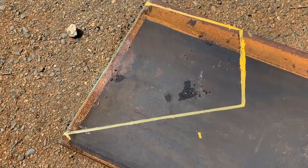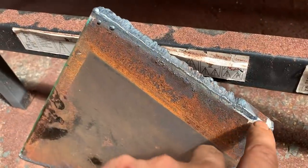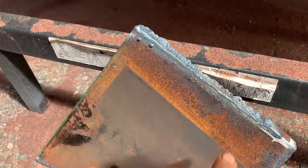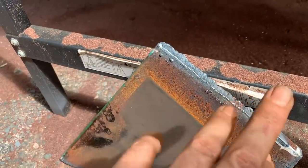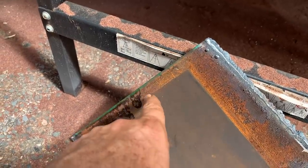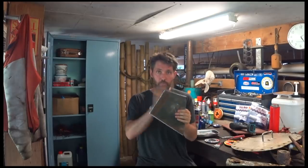This is my new one — it's pretty thick metal so I tried an oxy cut and I'm glad I did. It was so much faster than doing that with a grinder and quieter — which is actually the reason I use the oxy torch as much as I can: for practice and to keep the noise down. Now I'll just clean it up slightly and bevel it all so we can get a good solid weld. I wasn't so worried about the keel patches because there's not the same strain on them, but I feel there might be some strain on this skeg so I'm going to do a full bevel before welding. Unfortunately I ran out of time to weld the new skeg in, so I'll be doing that Monday morning. I've brought it home, bevelled the edges I'm going to weld, and started cleaning up the fore and aft edges as well — that shouldn't take more than half an hour to weld in.